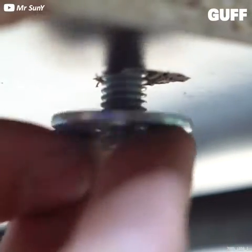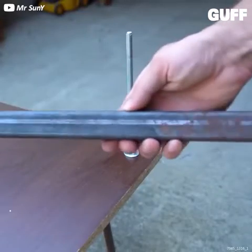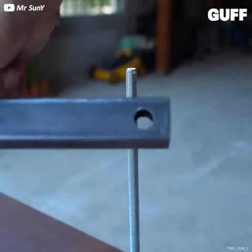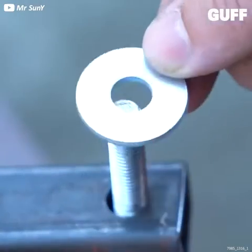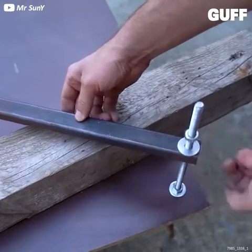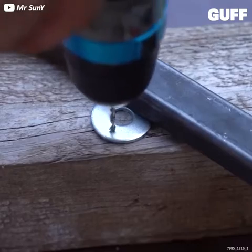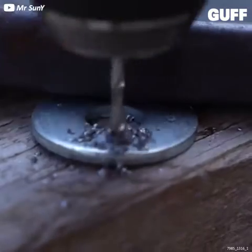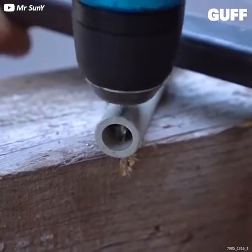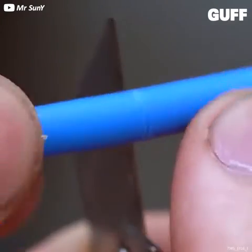And here's a handy idea involving a long bolt — you'll need a couple of washers and a couple of nuts. Once you secure that in place to your tabletop, whether it's a full-time workbench or not, you then drill a hole in a piece of pipe — preferably one that's flat on two sides, rectangular — and you can now use that to hold whatever you're drilling through in place on top of some scrap wood. Easy, adjustable, and made from scrap around your garage.